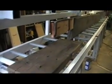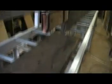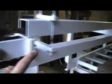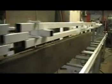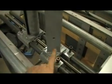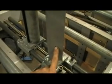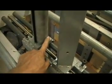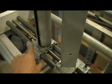The conveyor consists of two pieces basically: a simple bed made out of c-channel and the pusher. The pusher is right here — just a sacrificial piece of 2x8. It is designed to push on the wood and keep it going up into the blade. It's powered by a chain, front and back. The chain travels through the tubes all the way up to the saw. Here are our pinch rollers to guide the wood into the blade — they're adjustable. This pinch roller is fixed and will be aligned with the blade. If you want to cut one inch or one and an eighth inch slabs you set it for that width, and this one you can adjust for the size of the wood.